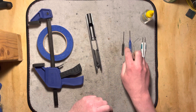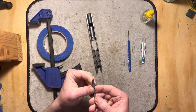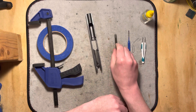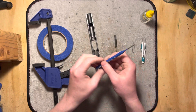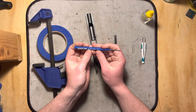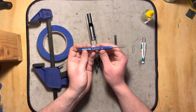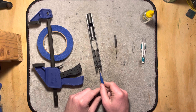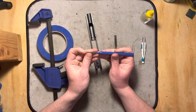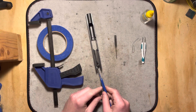You want to make sure that you have an appropriately sized roll pin punch — this one is a 5/64 inch roll pin punch. I'm using this mirror-finished end pin punch here, 3/32 inch, that we used in the frame disassembly video, and I'm just using that to apply some pressure to the firing pin while we're getting that retaining plate off. It doesn't have to be this exact size, just something that will fit on that.